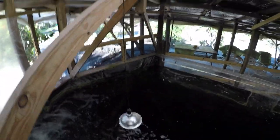Okay, so this is 4x4 that goes all the way to the rafter, which is also a 4x4. The rafter is 4x4, runs all the way to that corner post of the farm. Okay, that's another 4x4. This one is not on an angle, but vertical, goes in the ground about 3 feet, even below the pond level, which is about 1.5 feet below grade. It still goes about 3 feet down. I think it's 16 feet tall, 4x4.